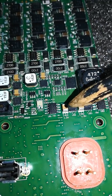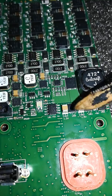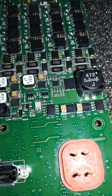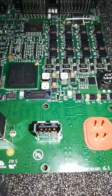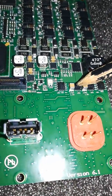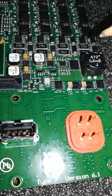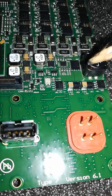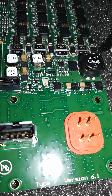When I started checking, I realized that when the ECU was dead — emitting the dim blue light — there was no 1.2V coming off this section here. So I started checking the resistors on the back of the board that determine the voltage of this IC; they all seemed good. I did a lot of comparison with this IC and the working one, as they are basically the same — just the resistors that determine the voltages were slightly different. I even managed to get the datasheet information on the chip, which helped me identify which pin is the output, input, adjust, and bias.